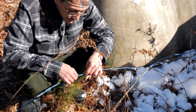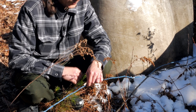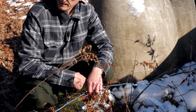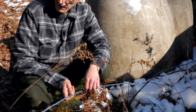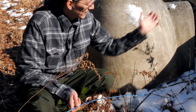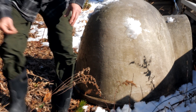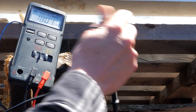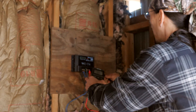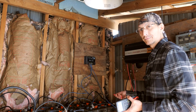This is the wire that feeds the battery bank all the way down the hill — that's got to be 150 yards. If we're getting 18 to 19 volts up here and down at the charge controller it was close to 12 volts, I'm surprised we're not losing more than we are given the wire size and that run length. We're losing about 6 volts between the top of the hill and the charge controller, and the charge controller is putting out 12.23 volts to the battery bank. Angling the panels up a bit, we'll go test again to see if we're getting a little more juice into the charge controller.